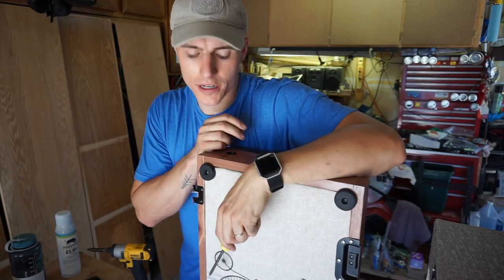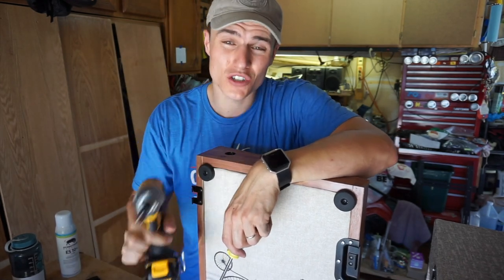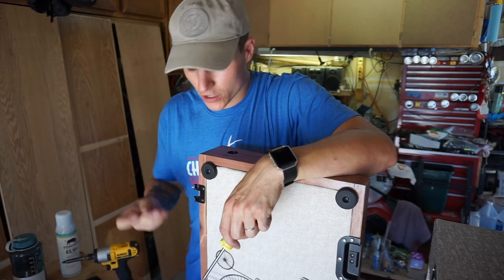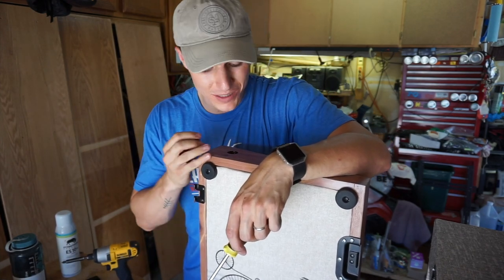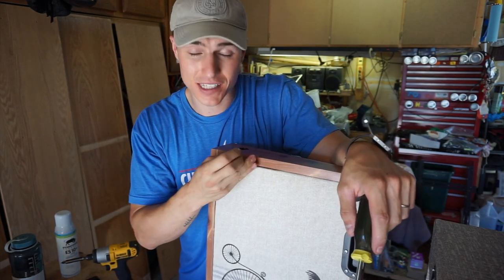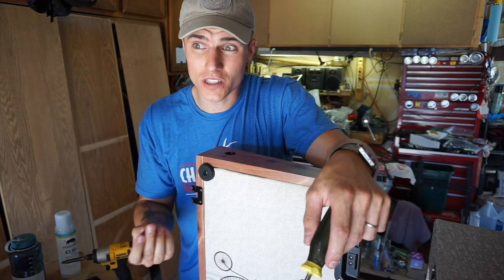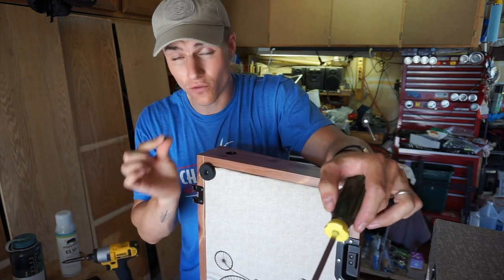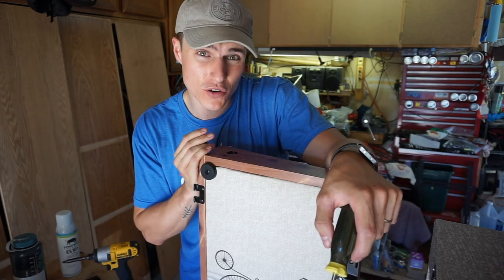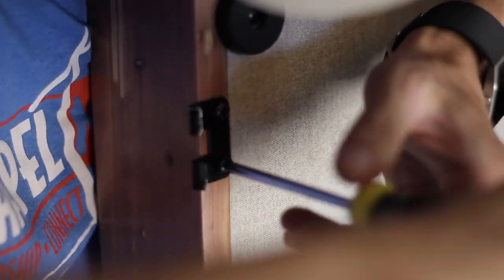Something that's important: when you're working with a nice piece of wood, you don't want to use big strong drills. If you screw it in too hard and too fast, it could crack the wood. You should always pre-drill, especially when you're working with something soft. This is cedar, and cedar is really soft. A lot of other woods are more brittle and will pop and crack if you try to force a screw in. I've been pre-drilling holes and using hand tools to fasten on the hardware.